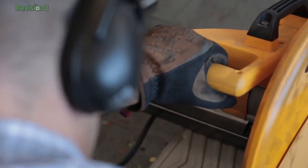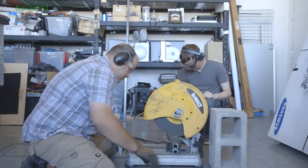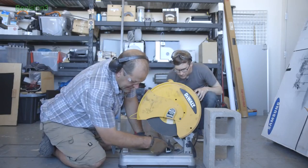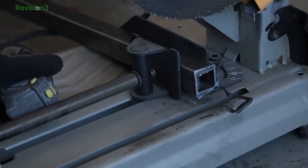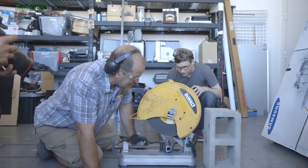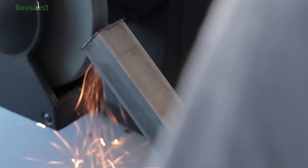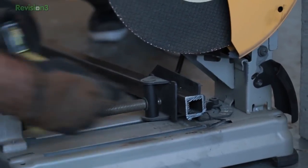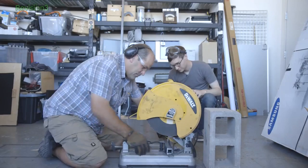We need to start cutting first, then lay it out, then start welding. One thing you'll notice is the blade creates these edges that stick out — as the steel melts and gets swept along by the blade, you get burrs. It will cut the hell out of you, as our shooter Matt can explain. So we'll be grinding that down — we're going to take the grinder to it, though a hand file will work just fine. We've got a nice square edge and we're going to use that to create our first piece of steel at three feet.